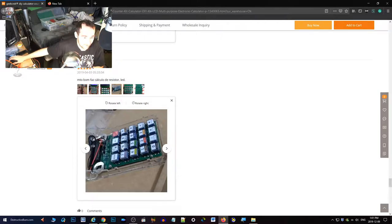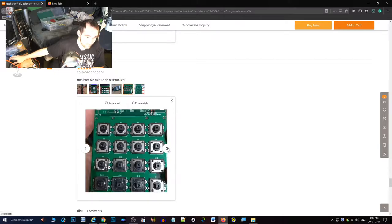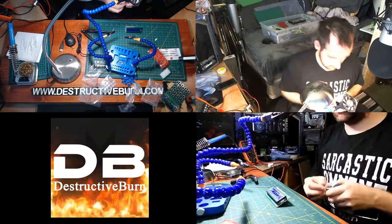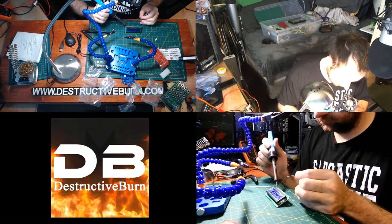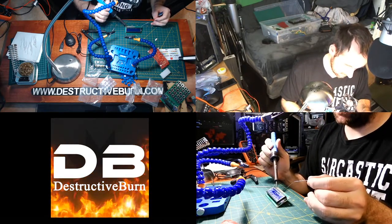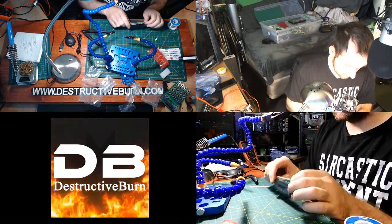I'm going to make that look as straight as I can. Someone's build also shows a wire so you could theoretically use a 9V battery, but this circuit runs on 6V from two CR2032s so a 9V would probably get pretty warm. I'll just tack the corners of the screen header down and have a look at the case before going further.